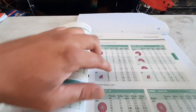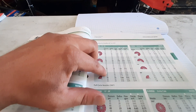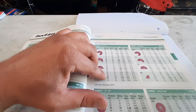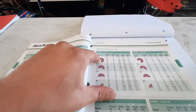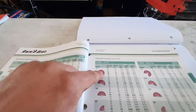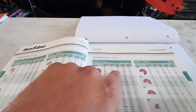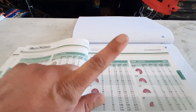Now you can go into the catalog and look at how much GPM a sprinkler will consume at what pressure. On a zone, let's just say because of what I had — 2.5 GPMs at 40 PSI — on this 270 nozzle, at 45 PSI I've already consumed it, and at 40 I've almost already consumed it: 2.31 GPMs off one sprinkler.